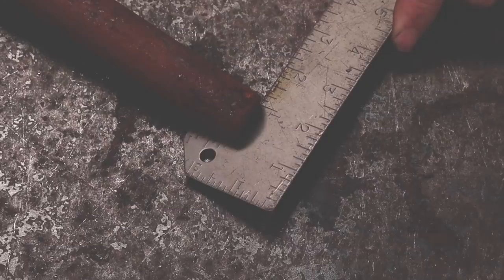And it's about 1 1/8 inch diameter. I'm going to reduce this to that 3/4 inch size that the original shows before I start work. So I'm going to cut a piece of this off, turn it into a rectangular bar, and then we're going to start working on the eye. But that means it's time to light a fire and get to work.